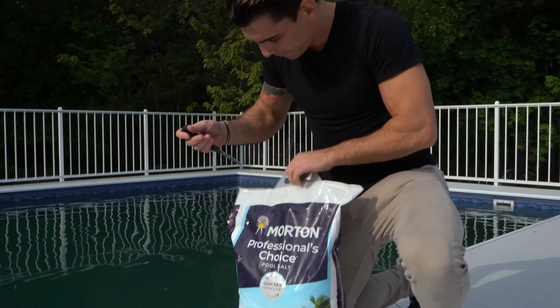After you put all the bags of salt in the pool, start the system running and let it run for about 24 hours. You should immediately start to see results. The computer should tell you the temperature and the parts per million chlorination that's happening in the salt water generator.